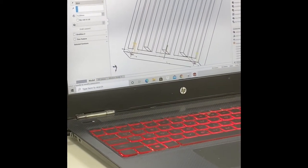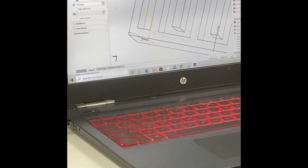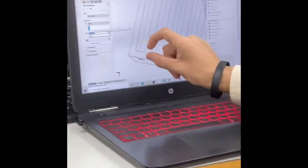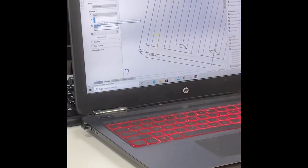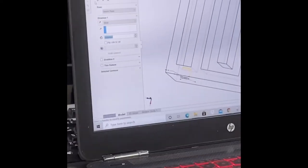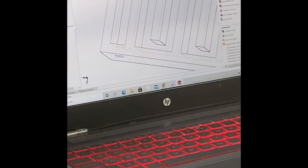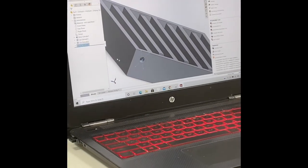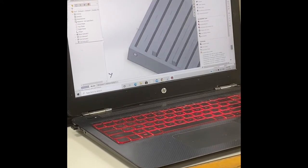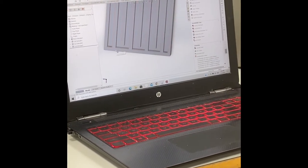Okay, it doesn't matter how much you want to cut it, because it will go inside and interfere with the channel. But if you want to be precise, you can give them 5 mm, because we made our reference there for 5 mm, so let's make sure that's right. And okay, so now let's go back to the solid field and see. As you can see, that was perfect there. And now we have our base of cooling plate.